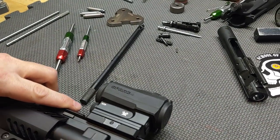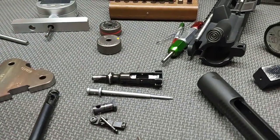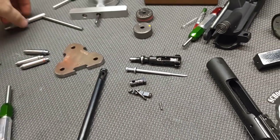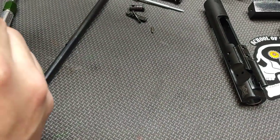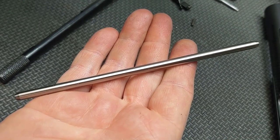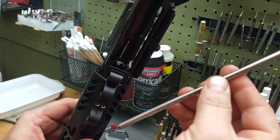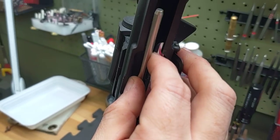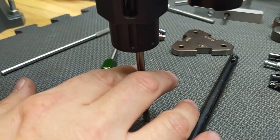So we don't fully pass that. Thus far we have a clocked barrel extension, excessive firing pin protrusion, and a shorter-than-acceptable throat. Next I'm testing barrel straightness. I'm dropping this copy of a military barrel straightness gauge in through the ejection port — it should pass straight through and hit my padded bench. And it passed straight through, so we have a straight barrel.